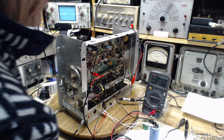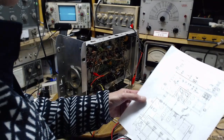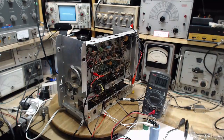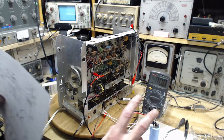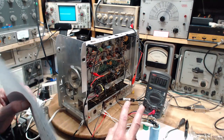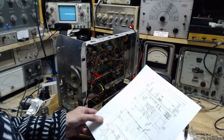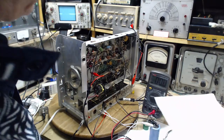Okay. Now, we have to figure out which capacitor it is that I want. I neglected to spot the number, so I'm just going to peek at the schematic myself. Yes, I did notice the number. The number is 5. C4 and C5 are in the same can here. What is C4? C4 is the other side. So this is a two-part capacitor doing both sides of the highly filtered 20 volt DC. So I've got to pick off the 500 side of it.